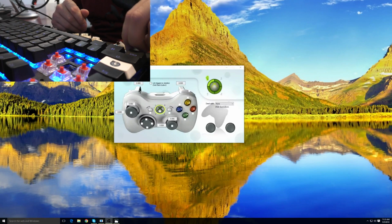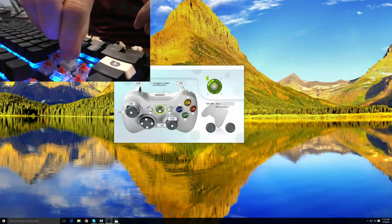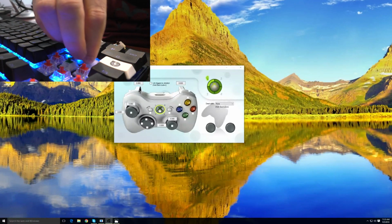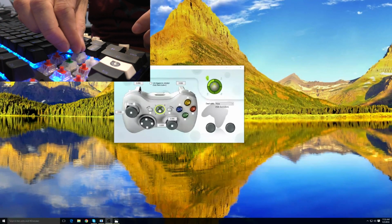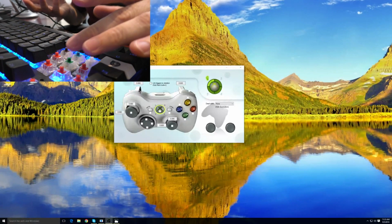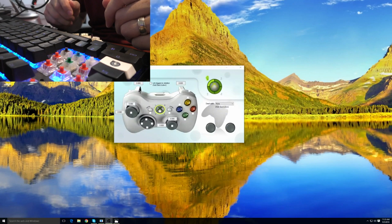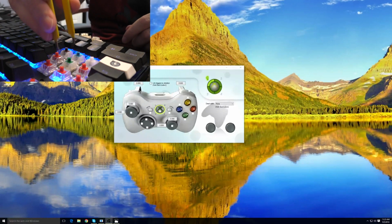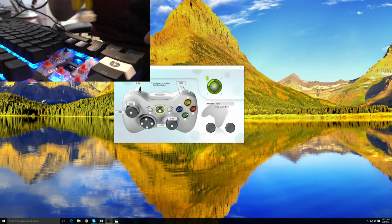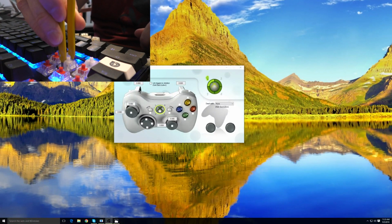And so what I'd like to do is first show you something interesting you might not have thought about. I can actually place these switches just in these little plates, and I don't actually need to solder these switches to the circuit board in order for the analog functions to work, because I'm using optical measurements, so I don't need any electrical soldering points. So I can place these key switches in here and pull it out with this little tool, and that will allow me to swap it in with some other type of switches. So just easily swapping back and forth.